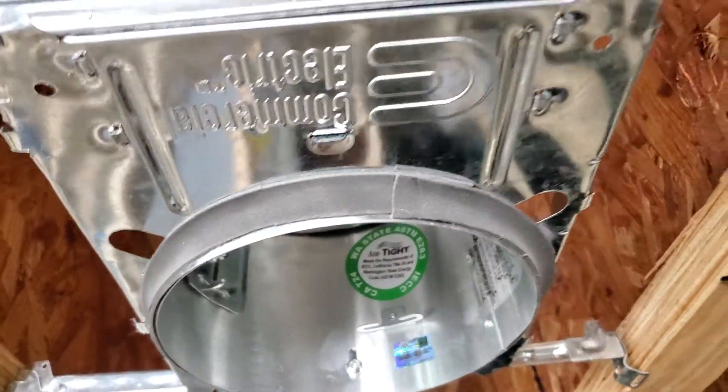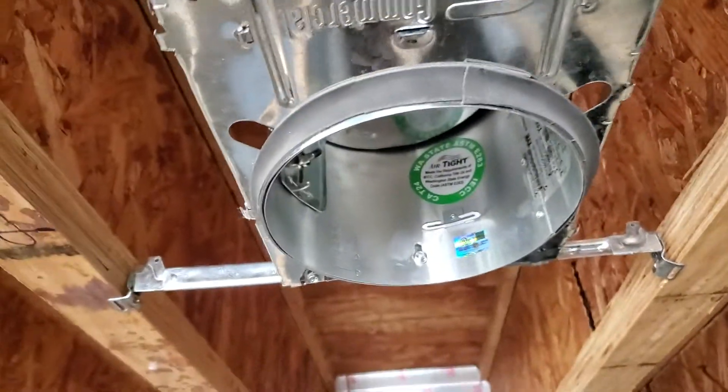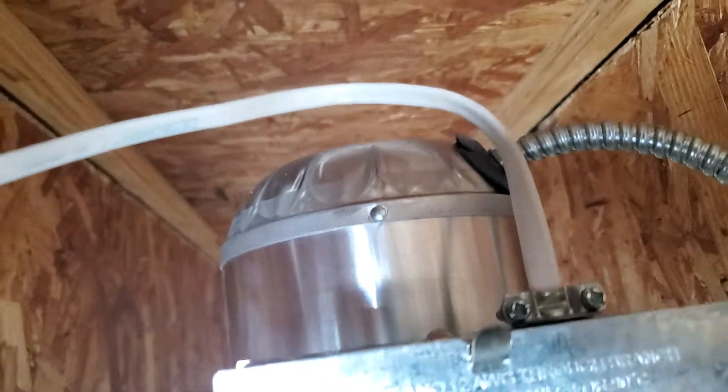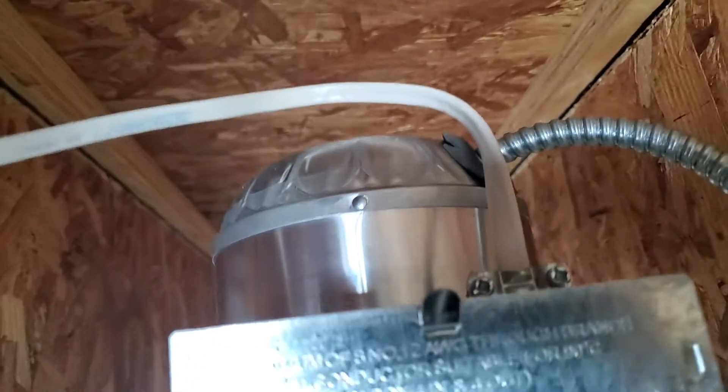You've got to have these types of boxes. Something else I want you to look at — this is good, it's all good. Look up here: I wanted to share with you my Romex connectors. A lot of times the wire comes in here and you want to make sure that you get this connector on there so this wire can't be pulled back out. These are the things that you're looking for.